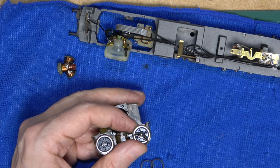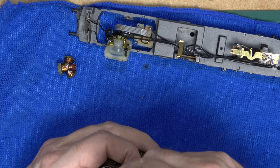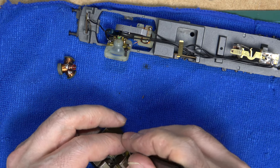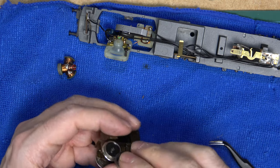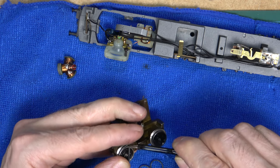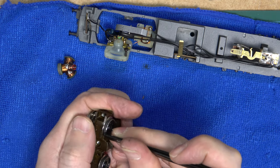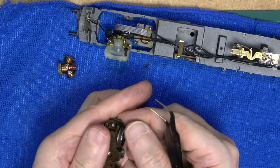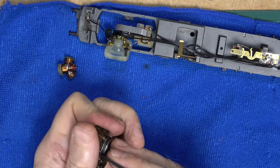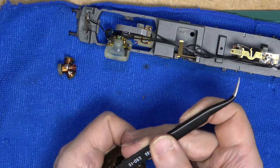Back to the task at hand. I shall fit my tires to the bogie. You insert the tire into its groove on the wheel, then hold it down with a finger. Then you can insert some tweezers or a small screwdriver between the tire and the groove in the wheel and slide it around to guide the tire in its groove - it will naturally fall into place. I like to make sure the tire is positioned properly. I place something flat on its surface - here the handle of my tweezers - and turn the wheel whilst applying very gentle pressure on the tire. This will be enough to straighten anything sticking out and avoid a wobbly ride later on.